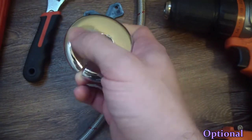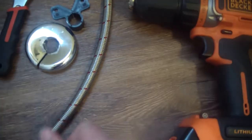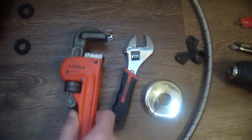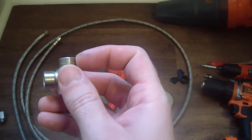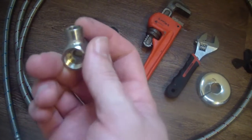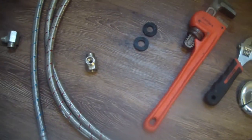A split flange — this is used to hide the hose coming through your wall. This is a PEX clamp, which is going to be used to hold the tubing from the inside. You'll need an adjustable wrench, maybe a pipe wrench but probably not. These little rubber washers are for underneath the bidet seat — they came with the bidet. You've got your hoses — red for hot, blue for cold. This compression fitting tee is a 3/8-inch fitting with a female end and two male ends that are screw-on connections, with its own rubber gasket to make it watertight.